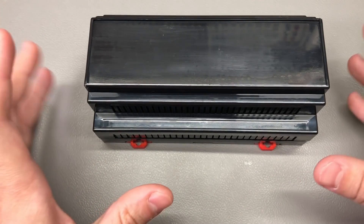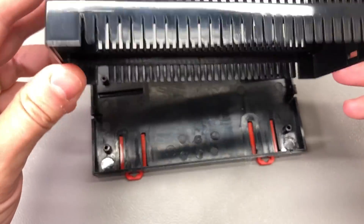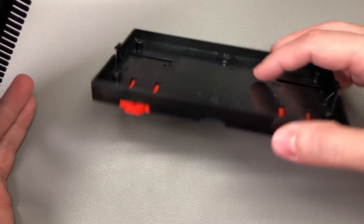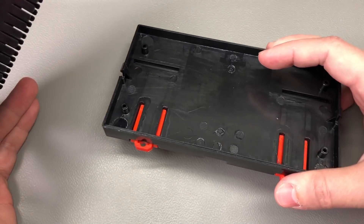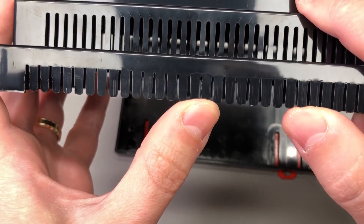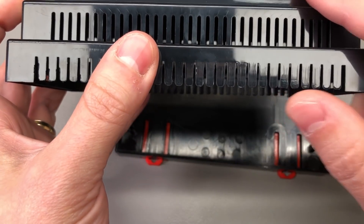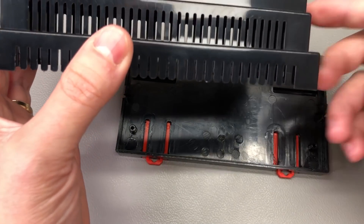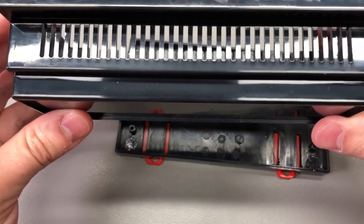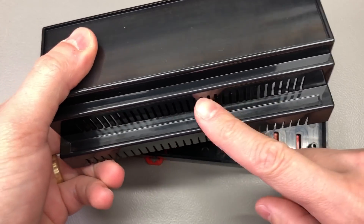Next up I have a series of products that mount on a DIN rail. I'll start with this project enclosure which looks like one of those industrial PLC controller boxes — super nice if you want to build a DIN rail mounted project. These come in a variety of shapes, configurations, and sizes. This particular one has pre-cut slots on the side so you can snap them depending on connector location on your PCB. It also has pre-cut vent holes on both sides, giving you natural convection cooling when installed on a horizontal DIN rail.